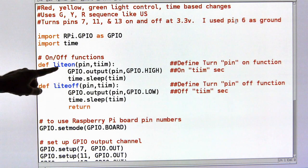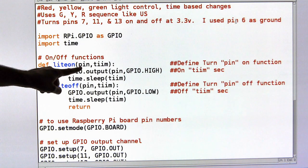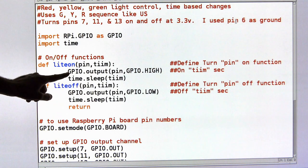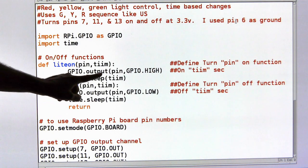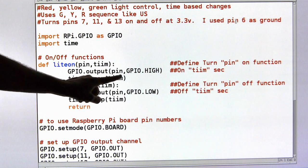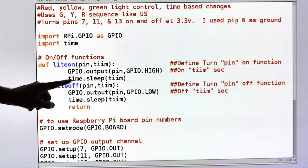So what do these functions do? Okay, well, light on is pretty obvious. It turns the light on. I'm going to tell it which pin, so for example, pin 7, and I'm going to tell it how much time. It could be 2 seconds, it could be 10 seconds, but I can tell it whatever. Then this little routine starts up, and it says, okay, output to pin whatever I told it, say pin 7. I'm going to turn it high, which means I'm going to turn it on. And